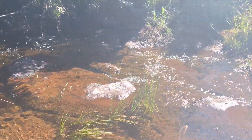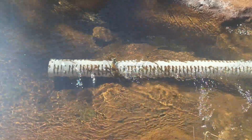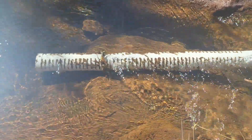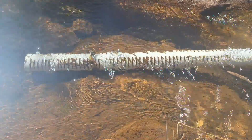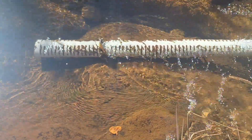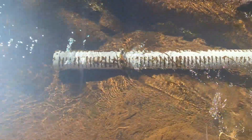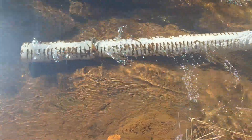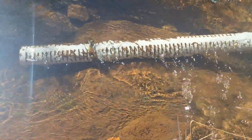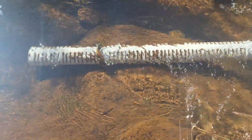This is the start of the supply pipe where the strainer is. We just cut slots in the strainer with a grinding disc, so the slots are roughly about 6 to 8mm wide, about 75mm or just over 3 inches each cut, and there are 3 rows around the pipe.